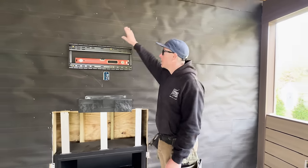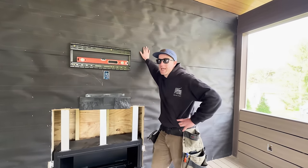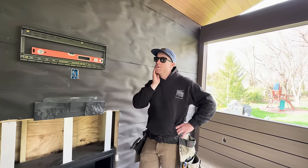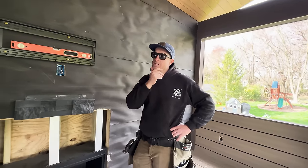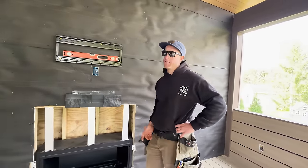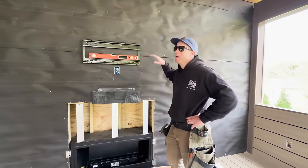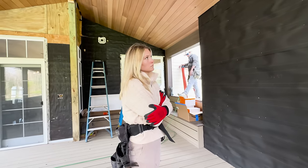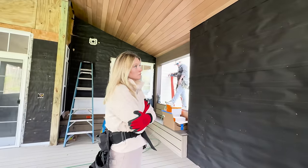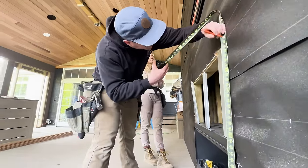No, because all the seams are going to be covered by the rips. I want to get it up on the wall and then sand it. I probably do want to stain the rips on top before we install them. But when you stain it and then put it up, it gets kind of scuffed up, and sometimes you have to put another coat on it, which makes it even darker. I might just want to hit it one time. Definitely want to get the 2x6s up first and sand them. Okay, perfect.